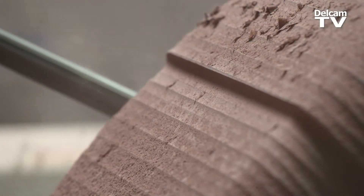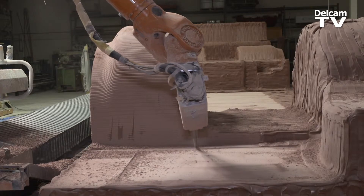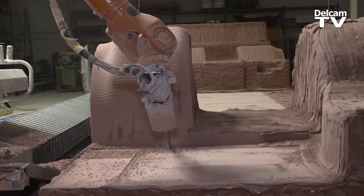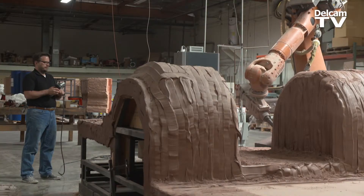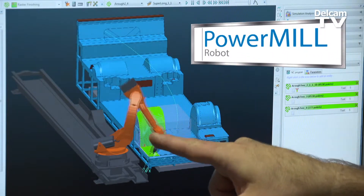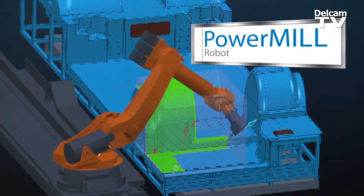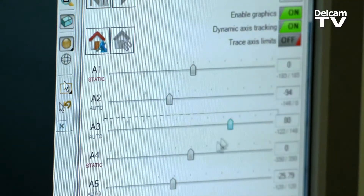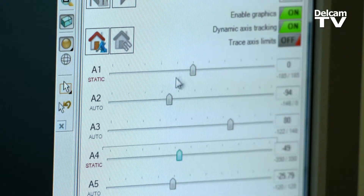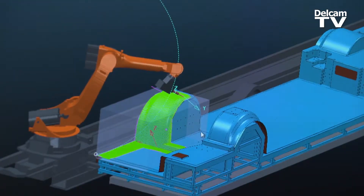This is a project we're working on — a direct mold for an electric bus. We did an undercut, sprayed composite on top of the foam using the robot, and right now we're in the process of doing the roughing and the finish cuts. With robotic milling you really want to be able to control every axis, and that's one of the great things that PowerMill and the PRI interface allows me to do. I can position and get the robot exactly where I want and then proceed to running the simulation of the toolpath.